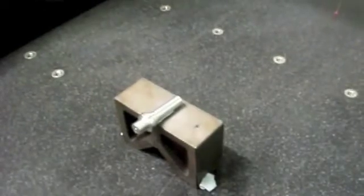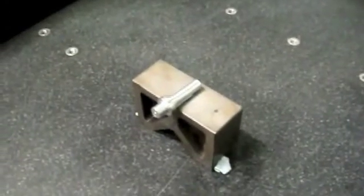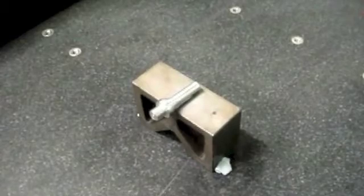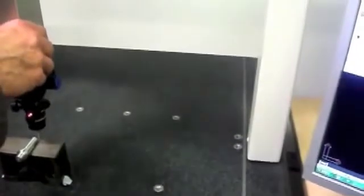Earlier tests show it seems okay, but it doesn't hold the part in position quite as well, so it will likely end up with more of the measurements showing the component to be out of tolerance. We're going to press OK. It wants us to place the probe near the right-hand side, lock the Y axis once you're there, and take some measurements around that diameter to ascertain it.